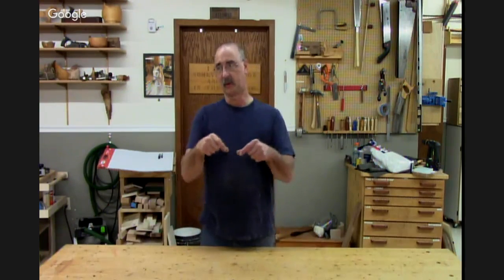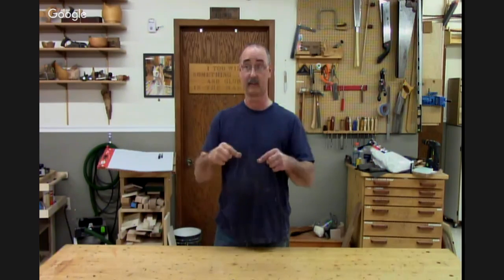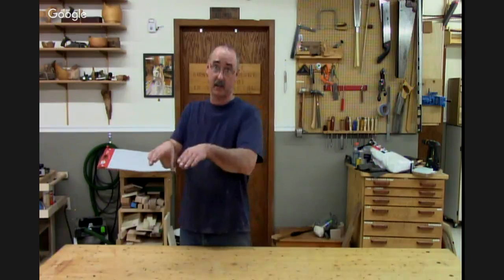End grain cutting board, the way to put it together is you glue together strips, and we do have this as a project on WWGOA. You glue together strips long ways as though you're making a conventional cutting board. So edge to edge to edge to edge to edge to edge. After that glue is dry, then we cross cut those, and the grain was going long ways.